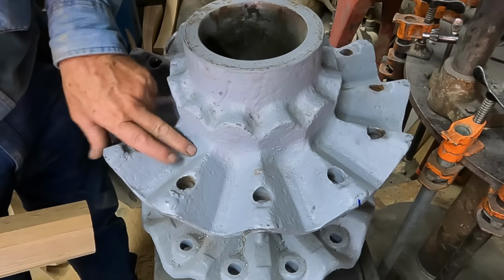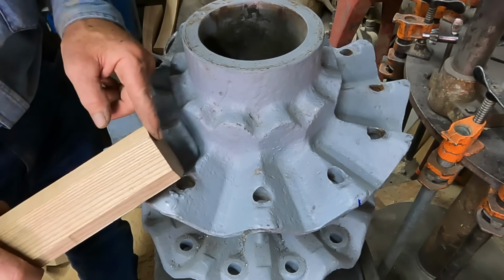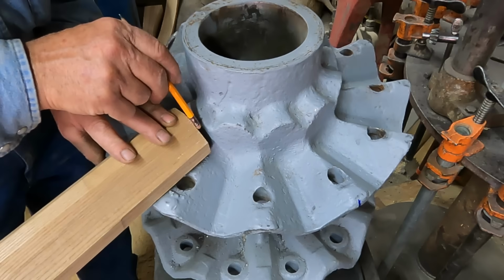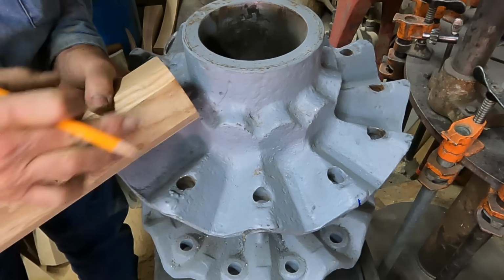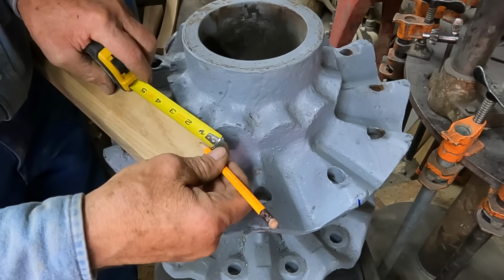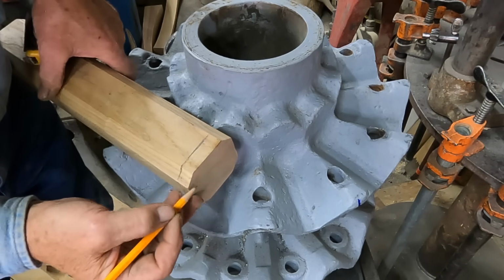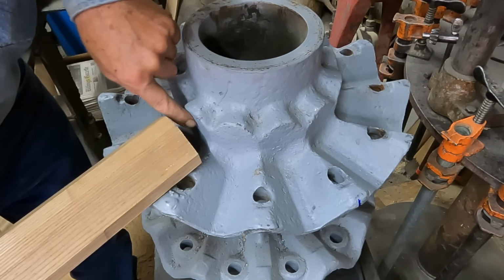Well, this is the inside corner that I need to round out the end of these spokes to accommodate. I'd like the bottom of this spoke to shoulder right up against this face. And right now it starts to hit that round spot at roughly 5/8. It's over half. So I'm thinking on two sides that I need to come back about 5/8 of an inch in there, and round this over, clear around, including this corner, so that it will shoulder right up and allow this to set up against this face.